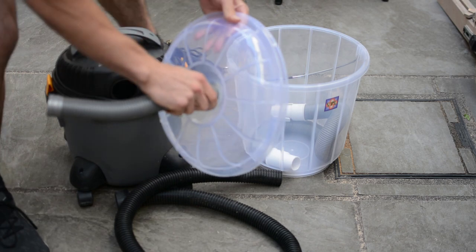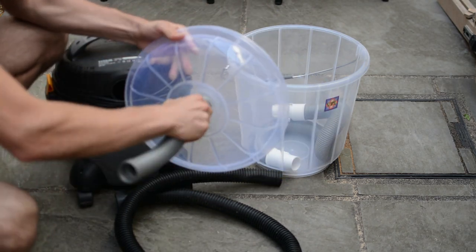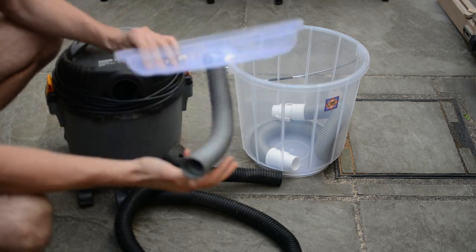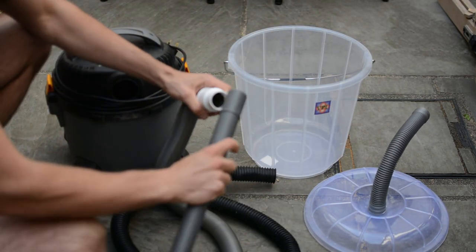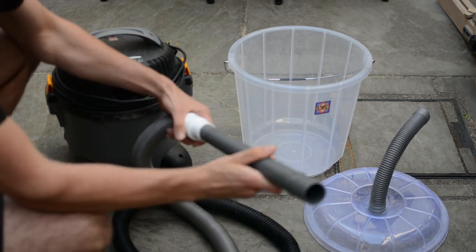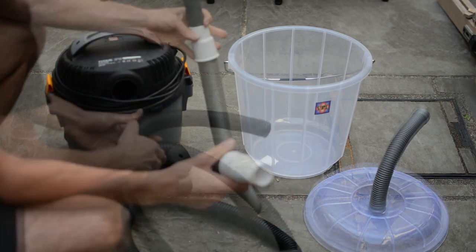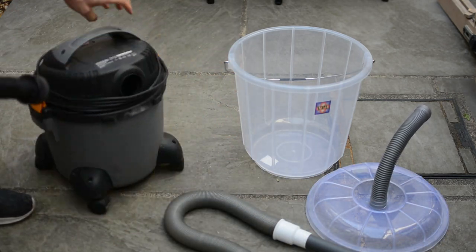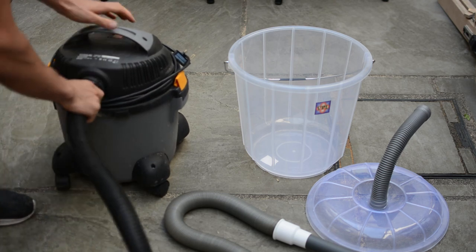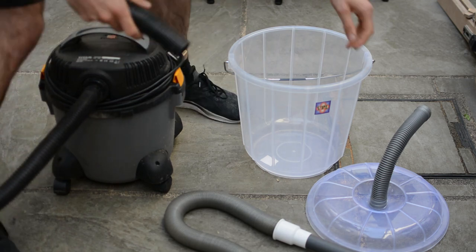I have seen similar designs made by others on YouTube and I wanted to find out whether it actually works or is it just a myth. So I decided to give it a try, given that I already have most, if not all, of the components. So the basic idea seems to be that you add a bucket on the way to the main vacuum, using gravity to collect heavier bits of dust or shavings and separate them from the vacuum's filter. Pretty smart and simple, isn't it?